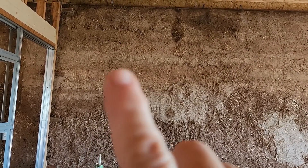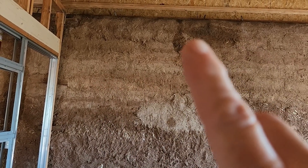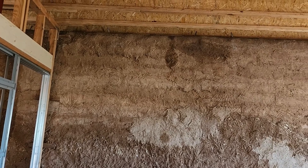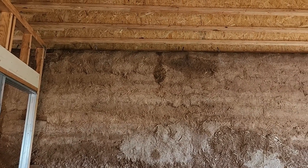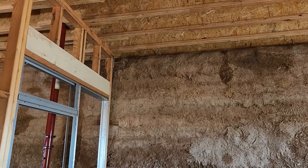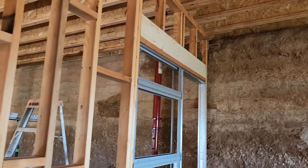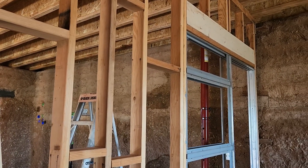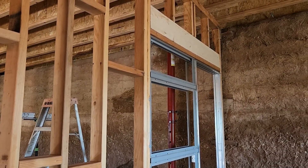Next up will be the living room. This is part of the living room — that's the north wall. You can definitely see where the cob layers were versus the earth bag layers: earth bag layers down here, cob layers up here. We do have a little bit of leaking happening, but we have not finished that roof yet, so that is why we're having a little bit of leaking. Hopefully the monsoon will be over in the next three weeks or so.